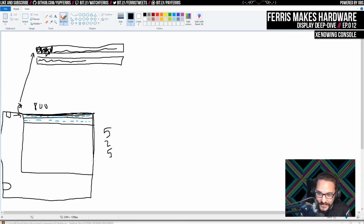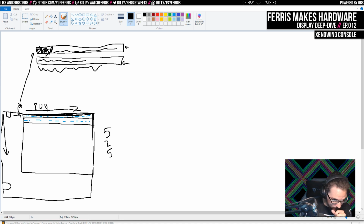There's the display unit, which is doing all of this. It has these pixel counters. It has an X counter and a Y counter. And it has an internal counter also for where it reads out of these buffers. There's 80 words in here, so it counts up to 80. And then, of course, that happens twice. And then there's also a couple output signals for when it needs to start reading, and also which buffer it's selecting, which determines what the other hardware that's fetching and pulling into this is doing, or where it's writing to, and then it also determines where we're reading from when we actually get the display data. So that's kind of the gist of it.